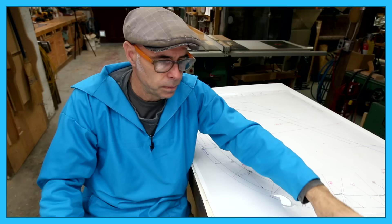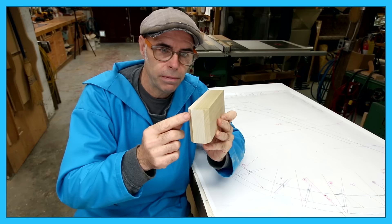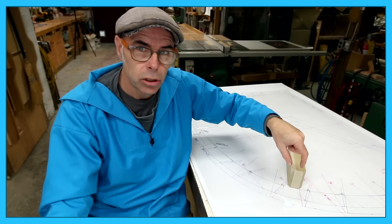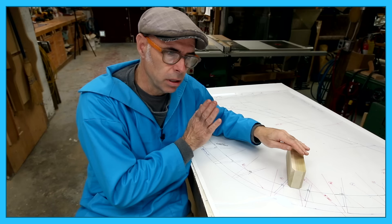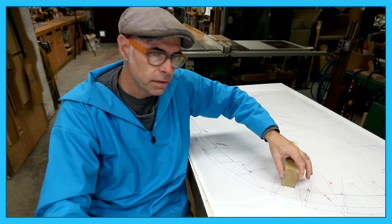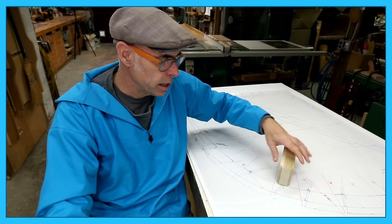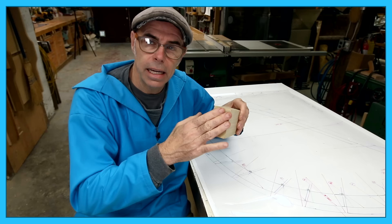I've often made sizable blocks, usually about six inches long at a minimum. One thing I like to do is chamfer the ends off on just the one face. As you stack these around the inside curve of what you want to laminate, having a narrower face on that inside curve ensures you won't get a really faceted result. If you've got a very wide face, the corners of that block will tend to dig into the lamination, but we still want a nice wide landing for the toe of your clamp so it's got plenty to hang on to.